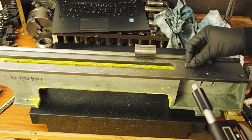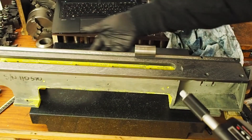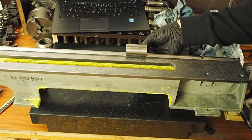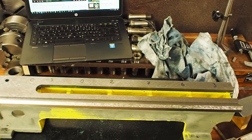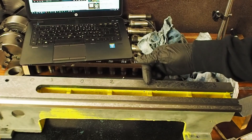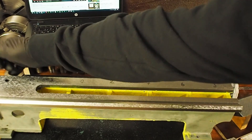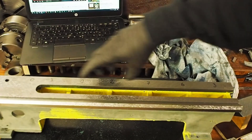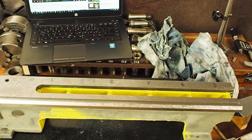The next check I've been doing is looking at the actual thickness to tell me how far I need to go on the underside of that way, and I use a gauge block underneath the way to even out the valleys and peaks of scraping. Getting close to the final scraping on the bed, we start off down around zero, have a slight rise up to about seven microns, back down to slightly below zero, and then up to seven again at this end. So when we touch off we should be seeing two prints, and once I've got those scraped level, then we'll be into final scraping for points.